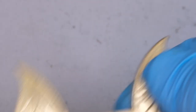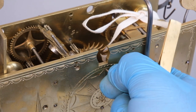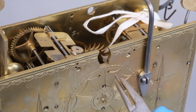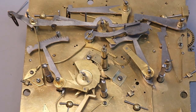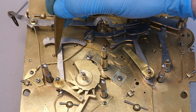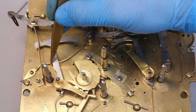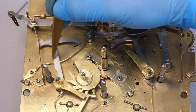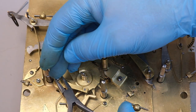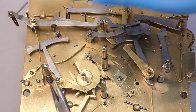What is later are these pins that are in the back plate — I think an attempt at some kind of banking pins to protect the escapement. When we look at the escape wheel, we can see it has new teeth. The next component on our list is the hour striking rack. This has knock-on implications — it means the hour striking train has to do more work than is necessary to gather in the rack. And secondly, as the rack drops, if the spring's too strong, it can actually fracture the rivet between the rack arm and the rack itself. So it's useful to adjust those springs so they're obviously functioning but only just, meaning no additional unnecessary wear is taking place.